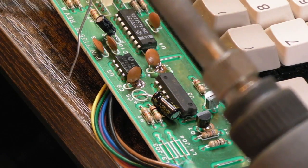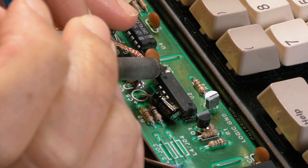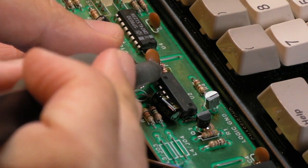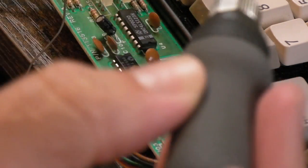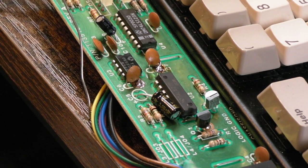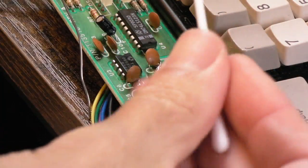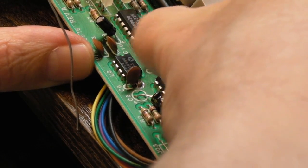Successfully creating some awful shapes in the solder here. It looks worse than it did before. When I first flowed that a second ago, it was alright, and then it's... And you know what? The temptation might be to blame Anthony here for crap soldering. He's not done crap soldering at all. It's the shape, as I say, that little plus shape that's around each pad. It means the solder goes weird, bleeding in odd orientations around.